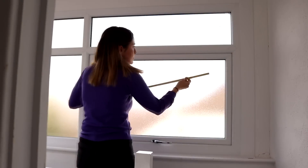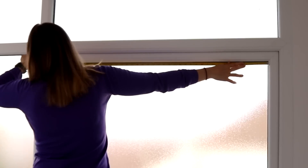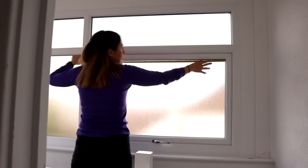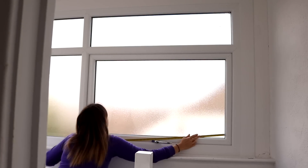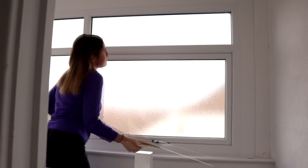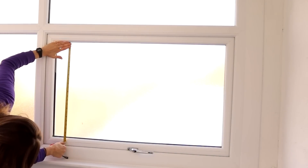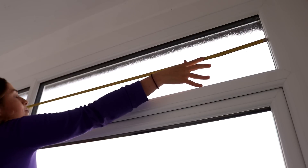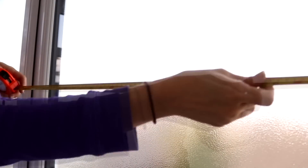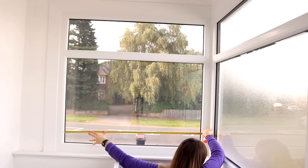For the measurements, always follow the company's methods. I measured the width of the exposed glass and took three measurements — top, middle, and bottom — and I only passed on the smallest measurement to Direct Blinds. I also needed the drop measurement, and because they are a perfect fit I had to do that for all sections of each window. Something I highly recommend: don't just take one lot of measurements — I measured mine three times just to be safe.